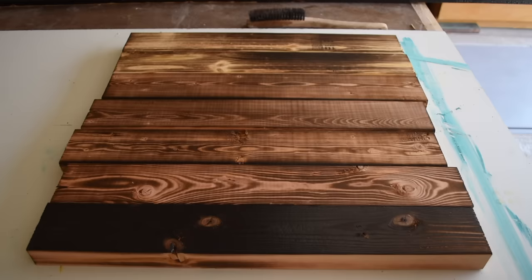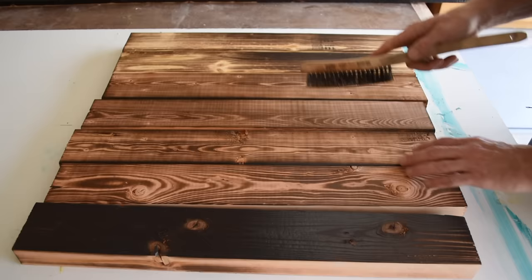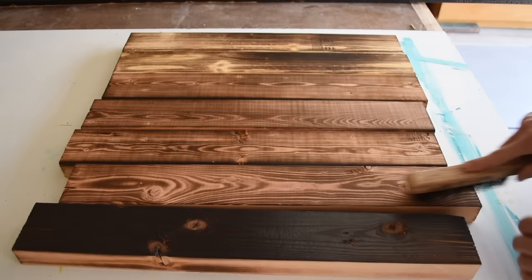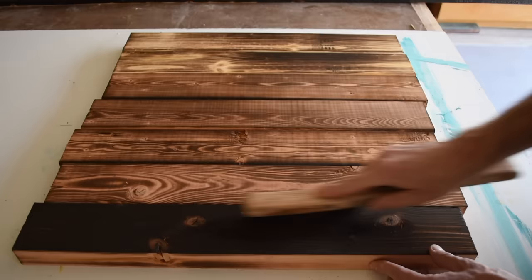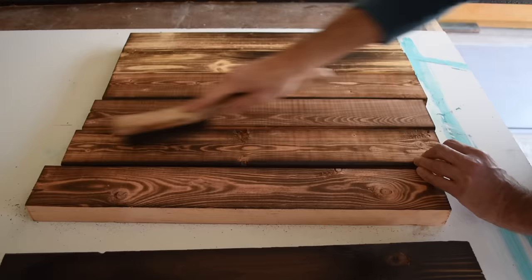Once you're done burning the wood and you've allowed it a little bit of time to cool off, we're going to come back in with a wire brush — just the same brush I'd use if I was welding — and give the surface a light brush. You don't want to brush too hard because you don't want to muck up the wood. This is just to break up the loose soot and ash on the surface. If you do a heavier char, you'd brush it a little bit more, and you can see how that brings out the wood grain. But for the purpose of the stained Shou Sugi Ban, you just need a light brush to break up any loose ash or soot.